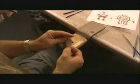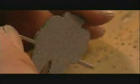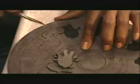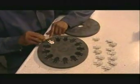Using a dispenser about the size of a sewing needle, they glue the pieces together with epoxy. It takes 5 minutes to dry. Then they cast enough copies of the master to fill up a rubber disc. After tracing the outlines, a worker uses a surgical knife to meticulously carve out the cavities. He softens the rubber with paint thinner to enable precision cuts. Then he places a copy of the master in each cavity.